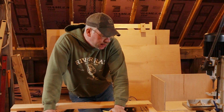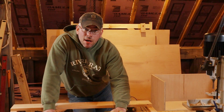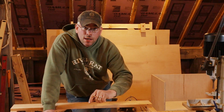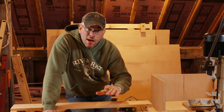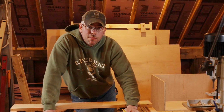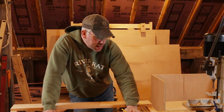It's getting late tonight. I've got to go in and edit yet from today's stuff. Like I said, tomorrow we're going to hit this hard, try to get this part done, get it mounted on the cabinet. We have dados to cut all the way around in the countertop. The reason I'm doing that is I want to make sure that if I have any discrepancies in that top or anything, I don't have any gaps where that thing meets the top of the cabinet, because it'll be the first thing the eye goes to every time you see it.